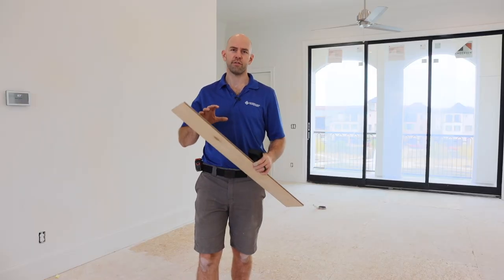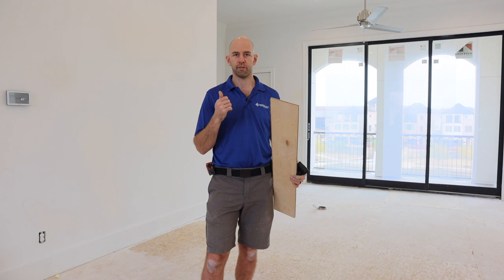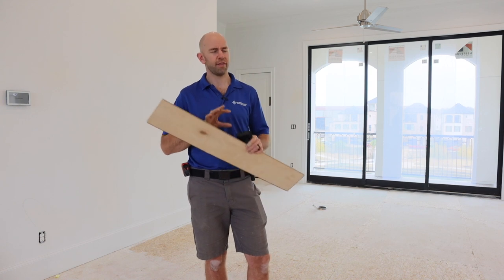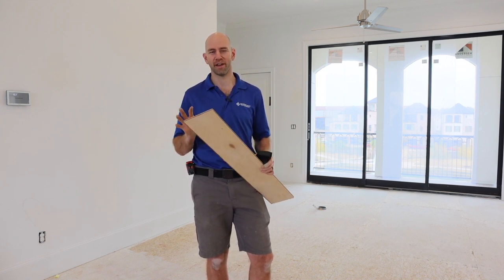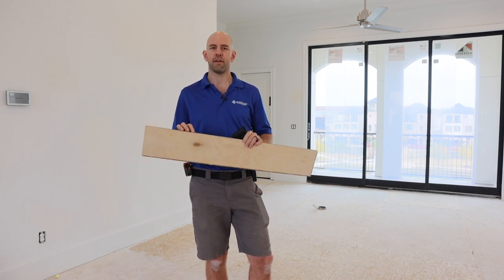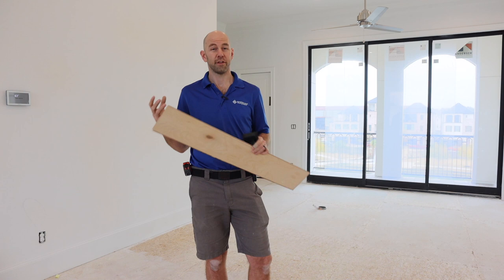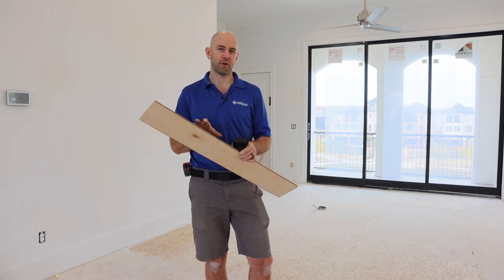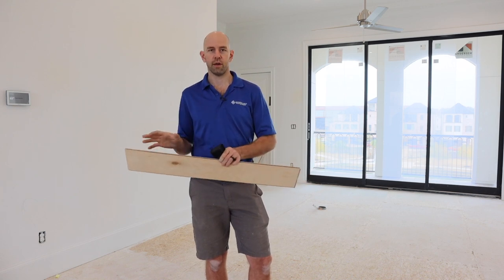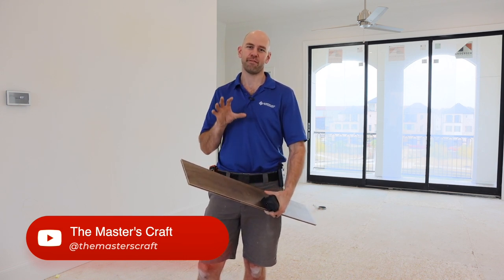Hopefully all of that gives you a really good idea for how to prep your subfloor. In summary, subfloor prep: you want to make sure it's clean, dry, flat, and structurally sound. For the flooring, the most important thing is reading the manufacturer's instructions. For an engineered floor specifically, the most important thing is making sure the ambient environment and the subfloor are within both the temperature, humidity, and moisture requirements they give you — you want to make sure the house isn't going to be too dry or too wet. Thanks for watching, I hope that helps you get set up for a perfect install.